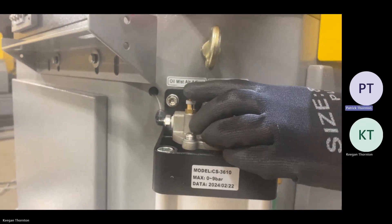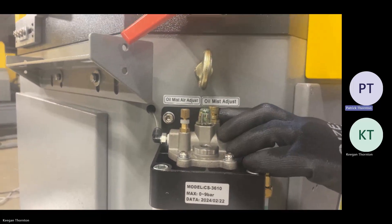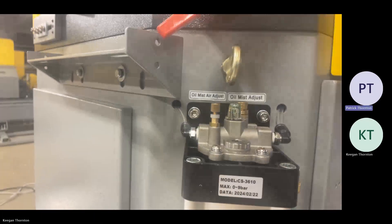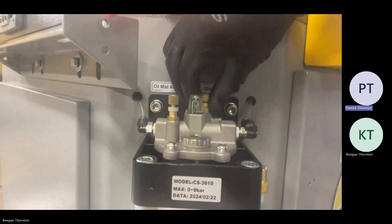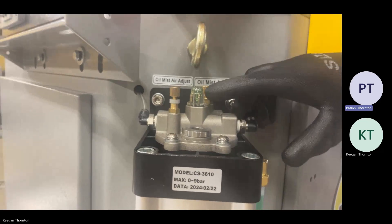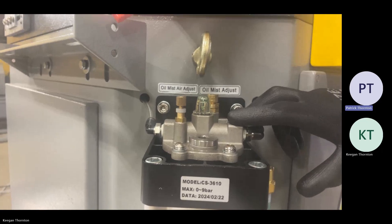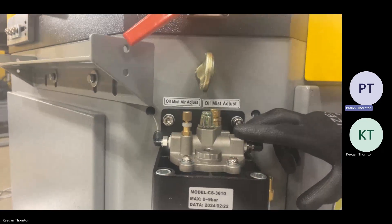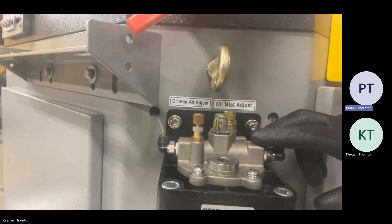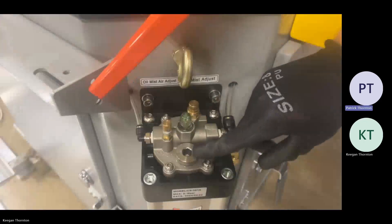On this side of the machine is your blade mist lubrication system. This here is for your airflow and this is for how much coolant you're actually applying into the airline. You want to have the airflow open, then have the coolant closed and slowly open it up — you'll see your drip rate right here. Cutting light-walled aluminum you want one drop every three to six seconds. A little bit heavier wall, you'd want three seconds; a little bit lighter wall, closer to six seconds. You fill this system by removing that cap right there.